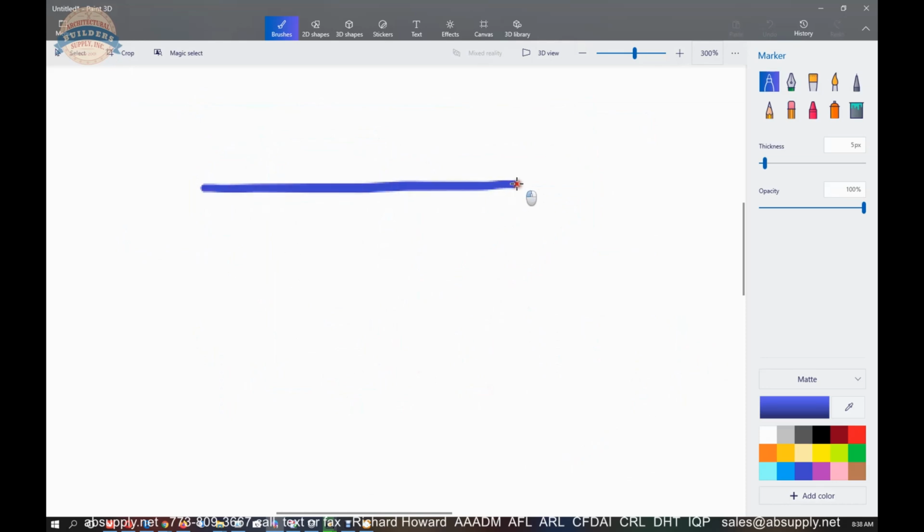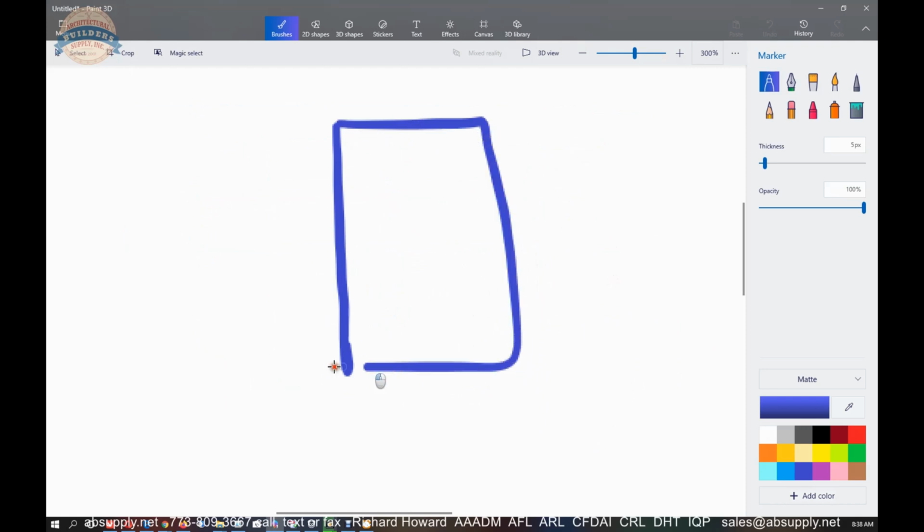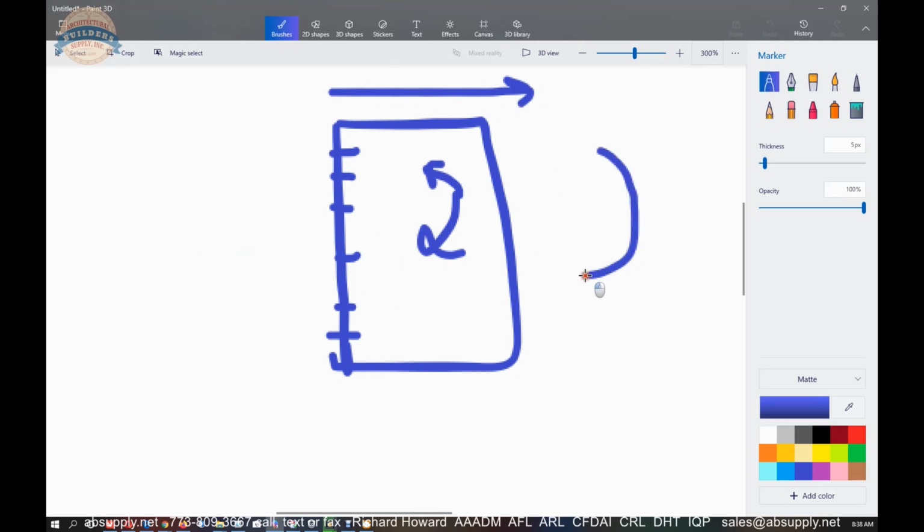One telltale sign when you have your door and it's double acting, that you don't have enough spring power, is it hits the jamb over here when it's moving. What really happens is when you've got your door hanging, your hinges, especially if you don't have adequate hinge or your door is too heavy, the door actually moves out this way as it double acts through the opening. It actually goes through a slight elliptical. It doesn't just make a perfect arc either way when it double acts. It kind of goes elliptical a little bit,